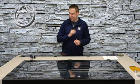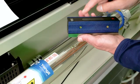This whole time we've been setting the level on the linear rails inside of the machine, and that's what I recommend doing. However, when we're done getting all of that leveled out, I recommend coming back to the back of the machine and checking out the level of the laser tube as a prelude to checking and aligning the mirrors on the machine.